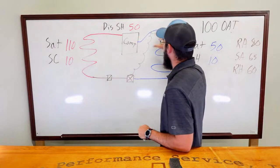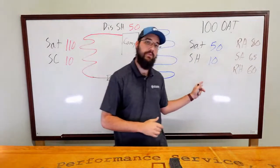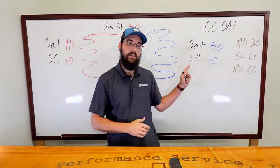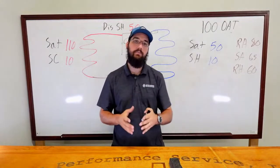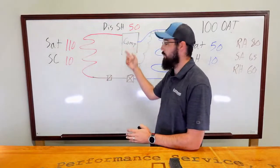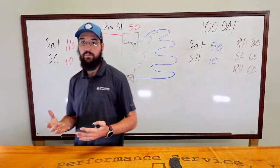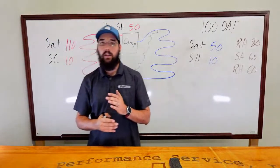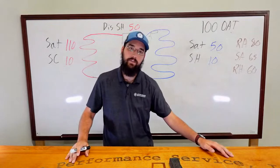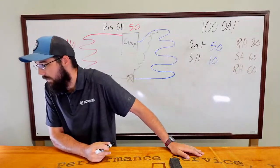But yes, because your total volume of refrigerant reduces, even though it's the right temperature, doesn't mean it's actually enough to keep that compressor cool enough. And inevitably that heat just builds up enough. And you get a weak thermal limit internally and it only goes downhill faster further.